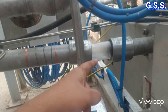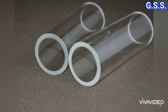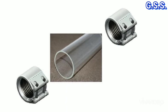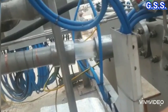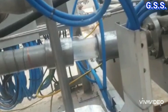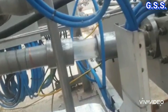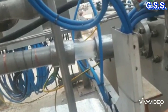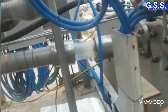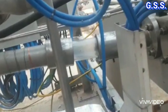This is an enlarged view of the sight glass installed on the lube oil return line. The sight glass is a bare sight glass and was mounted in the lube oil line using two strap grip couplings. The reason for the electric spark is that when oil flows through the pipeline, static electricity is generated in the oil due to friction — particularly when oil flows through the oil filter. Both the oil filter and pipeline get statically charged. Since this sight glass is not conductive, the statically charged oil and pipeline generate a spark while entering the non-metallic sight glass due to electrical discontinuity.